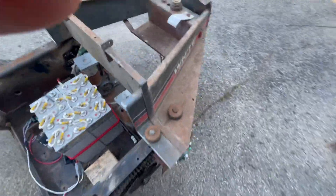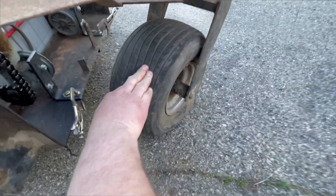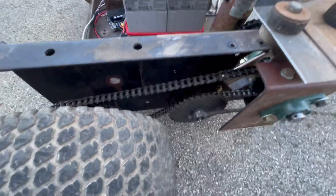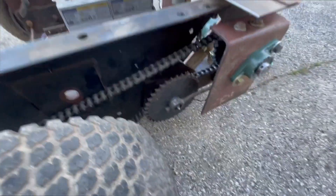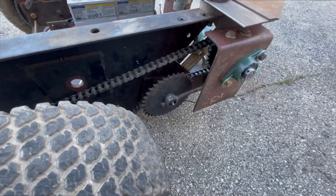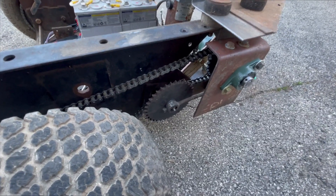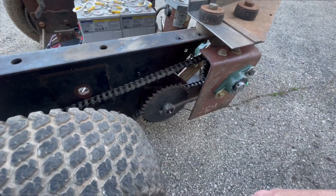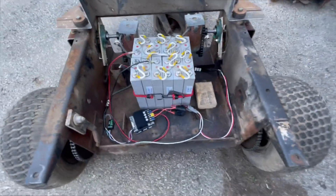Some of the issues: first, a rear tire I need to fix - it loses air just about as fast as I put it in. These sprockets here are originals and they're really loose; the shaft is worn down from not getting any grease. Those are certainly not helping with the chain noise and probably some of the issues I'm seeing with reversing directions. It's also a lot of lost efficiency, and driving is not the best when you're dealing with a battery pack that takes extra time to recharge versus refilling with fuel.